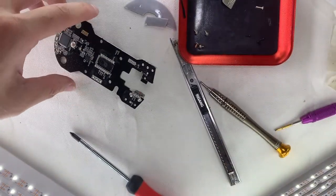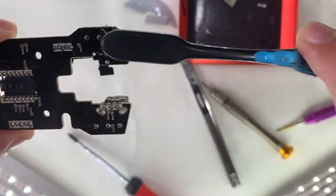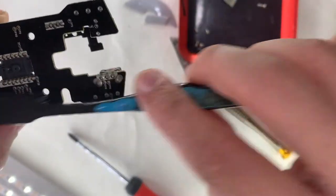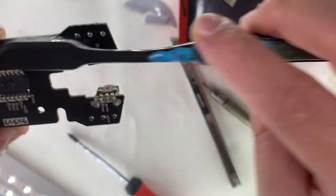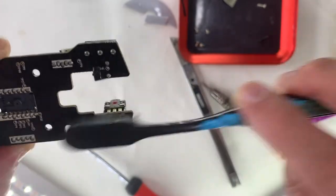Next, using a trusty brush, doing some general cleaning with a contact cleaner. I spray the contact cleaner on the brush to make it a bit wet and then brush the front and back of the board.